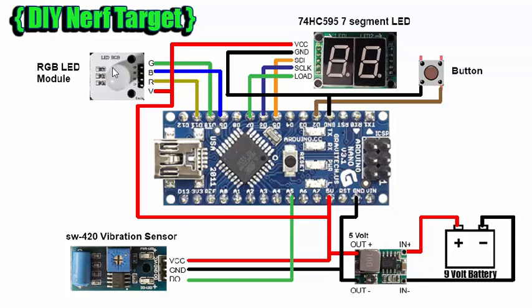The other module that I use is an RGB LED module. Something to take note of is that sometimes this type of module connects to ground — you'll see a negative rather than a positive. Mine connects to the 5V supply, so you have to be careful. When you buy the RGB LED module, check whether it's a positive or negative. If it's negative, connect it to ground and change the program values from 0 to 255 — just reverse it and you get the correct color.